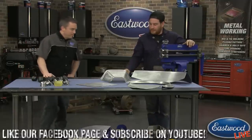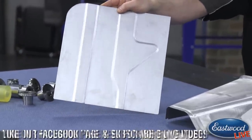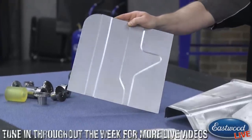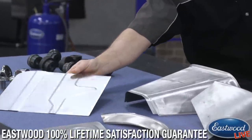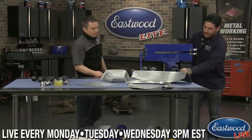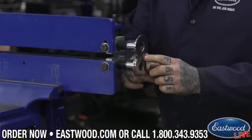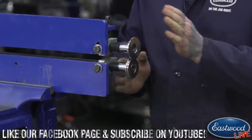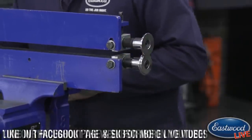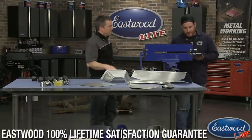So first what we're going to show you is how to recreate — like if you have a floor pan or the side of a bed of a vehicle that has kind of a pressed look to it that would have been stamped originally — by using these offset dies here we can actually lay out our panel and run it in a manner to recreate that. You can separate these dies and offset them to change how much of a step is in the panel, creating a more gentle step or changing the angle of the step.